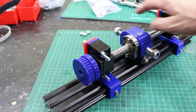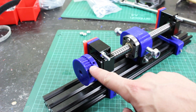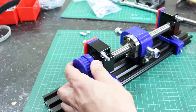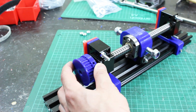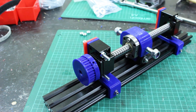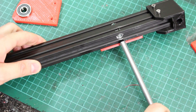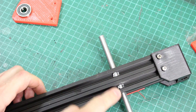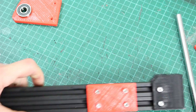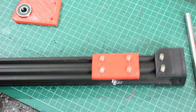I've got a 3D printed T5 pulley on there, which was the same as the Exosuit, only this one has a grub screw instead of being push-fit, so hopefully it won't come off. I'm gonna mount the motor, get that knee joint mounted at the other end, put the rod in, and then we can actually test it. I drilled a hole in my lower leg for the 10mm studding to go through, but that has actually cut through most of the aluminium, so there's hardly anything left for strength. I've made these plates that will go over the side of the hole — eventually they'll be CNC'd aluminium, but for now it's plastic.